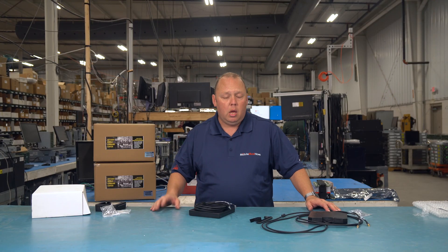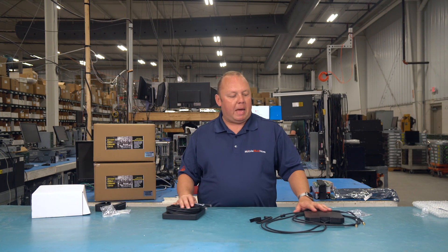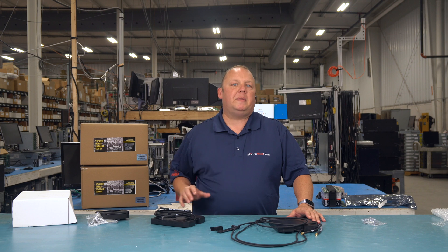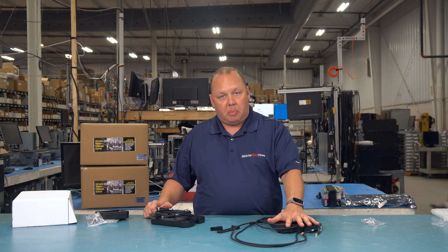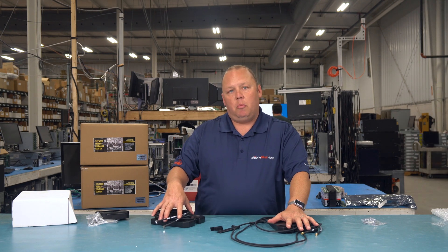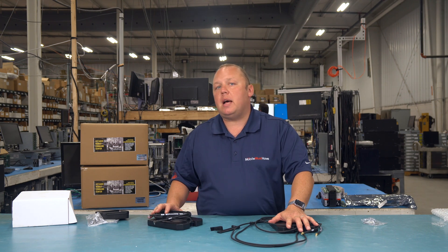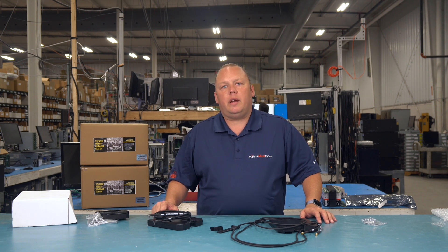Parsec has given us word just as of yesterday — we mentioned we're filming the video right now — that they are looking to change up how this works from a TS9 and SMA connector perspective in the coming months. Could be Q4, could be a little bit earlier in 2022. Just look at the description and we'll update that if they change anything related to what ships in the box. PepWave devices will want SMA connectivity, and mobile hotspot devices typically will be TS9, but check your mobile hotspot's connectors as there are some other connector types out there.